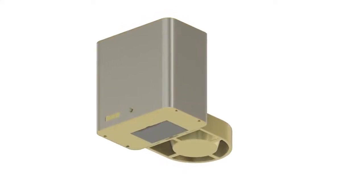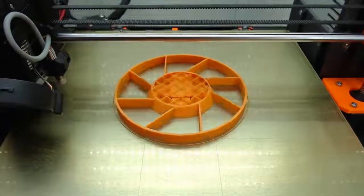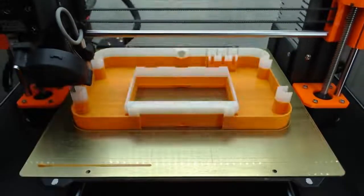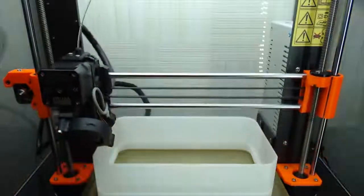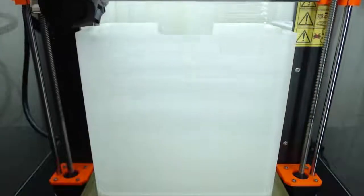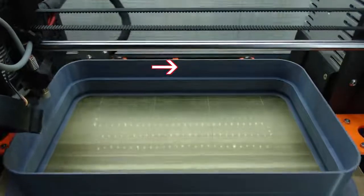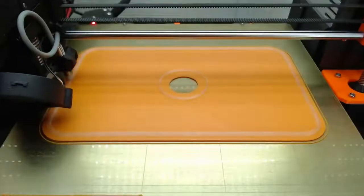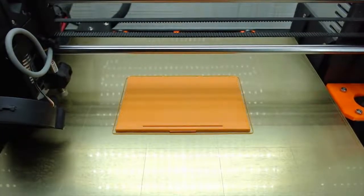First one is the hopper, it's the hardest one. Then the portion wheel, wheel compartment, electronics compartment, bowl, shell, for which I recommend adding a brim, even PLA could warp otherwise. Also set the seam position to rear if you want a clean front side. The next is the lid and an optional battery cover.